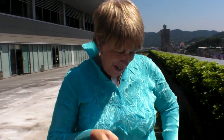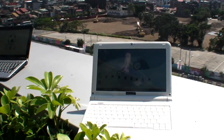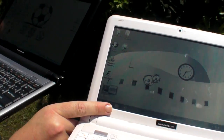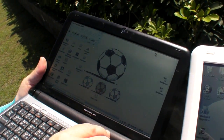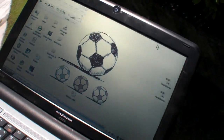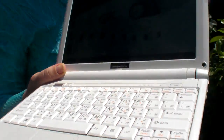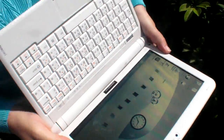Android also has pretty good text. The 10-inch capacitive demonstration shows wide-view capabilities. We've got wide view working now, though we haven't combined wide view with capacitive touch yet — actually the first one is in our offices right now. There's a small rainbow artifact we've fixed on the capacitive touch. This is a much wider viewing angle, very good for tablets. We'll be showing it in a tablet tomorrow. The capacitive layer does add some layer on top — we glue it down — but it works.